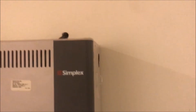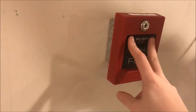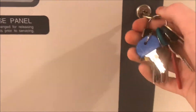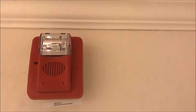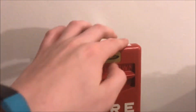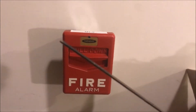Nothing too different with all the wiring in there, and hopefully soon there will be - but that's a surprise for later. Starting off, we have my ADT 5060s dual action push-then-pull pull station, which also takes the Simplex B key. It is 0.9. Going up, we have the Gentex Commander 3 set at continuous horn and 75 candela. Over here is the Gentex Commander 2, continuous horn set at 75 candela. Down here is my Faraday F1 GT chevron set at 0.3.